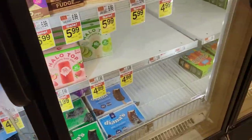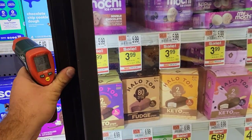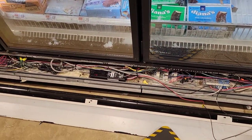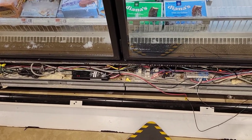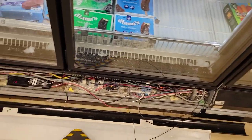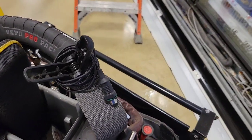I'm going to have to end the video here because my phone's about to die, but I can physically see it's raised 10 degrees. So this is working — I can also see the moisture evaporating off of it. That's how you do this thing. Hopefully you learned something. If you know something about these controllers, comment below — they're kind of a mystery. I'm going to email the company to get the product information. Basically, what that thing does is it uses this little probe, calculates the dew point, and it turns on and off the door frame heater, the anti-sweat heaters on the doors, and the door frame heaters. It just wasn't set up right. Hope you learned something — please like, subscribe, and all that.